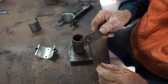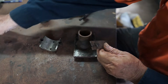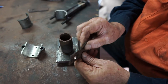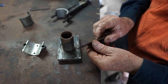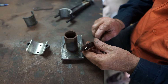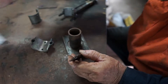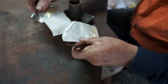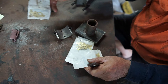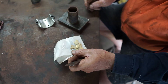Now I've turned up or fabricated and filed up these two little spacers. The shims that are between the two bearings are about three millimetres thick. So I've got a piece of three mill flat — and that can be smaller or bigger depending on your bearing size and what sort of space you put on your bearings. I generally put laminated shims. Here we have some — they're Model A Ford, Model T, Model A again. You can buy these from Snyder's or other suppliers.